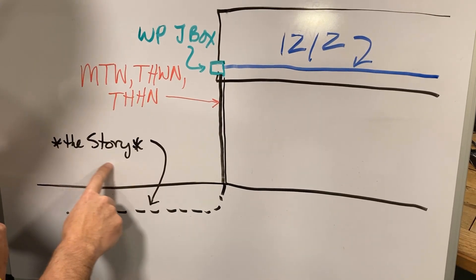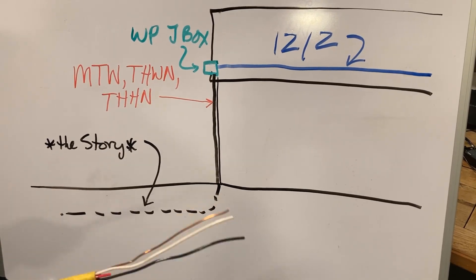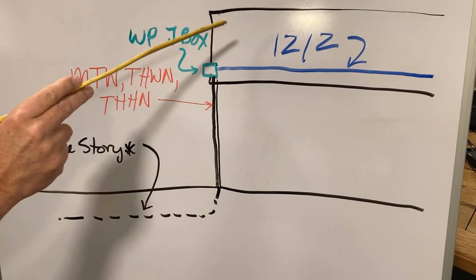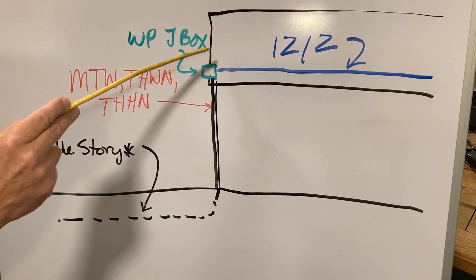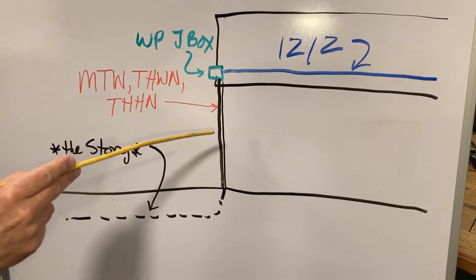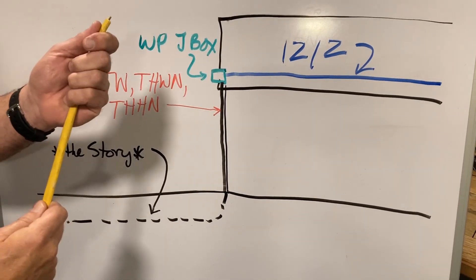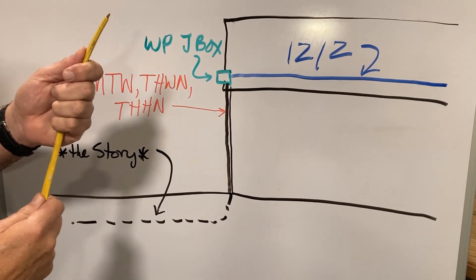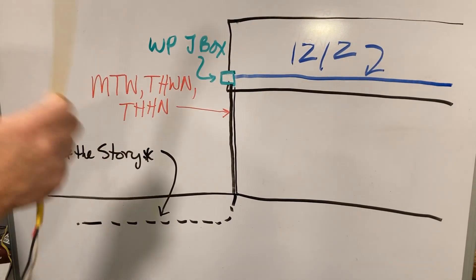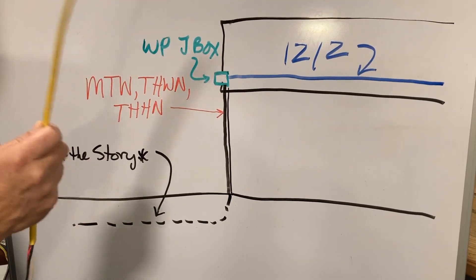So why does this involve four things we have to do? When you're talking about putting Romex in conduit, we've got to talk about: location — damp, wet, protected, unprotected; and fill — which is what this story is about. Are we cramming too big a Romex into too small a conduit? That's a real thing. Usually people say, 'if it fits, it ships,' which is very cynical because that's not right.